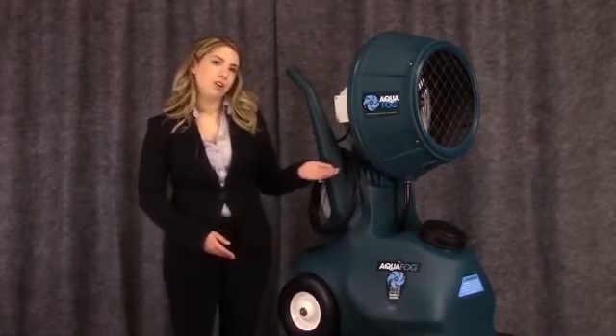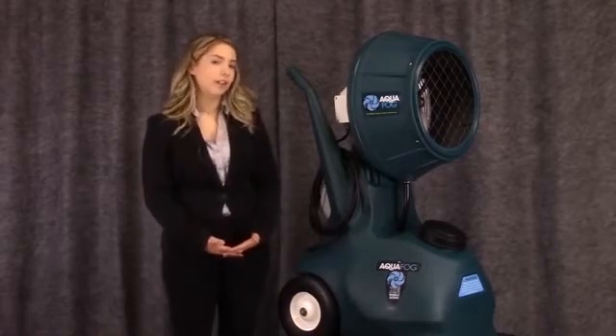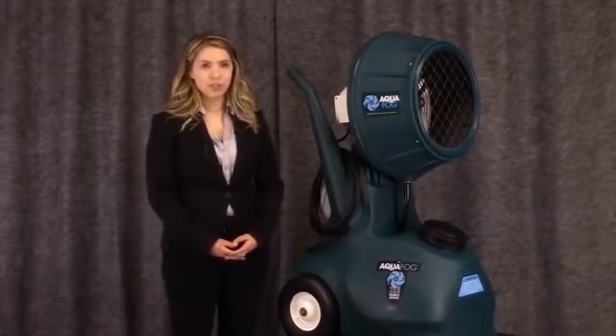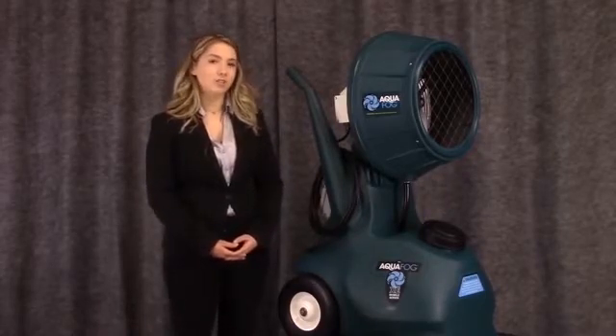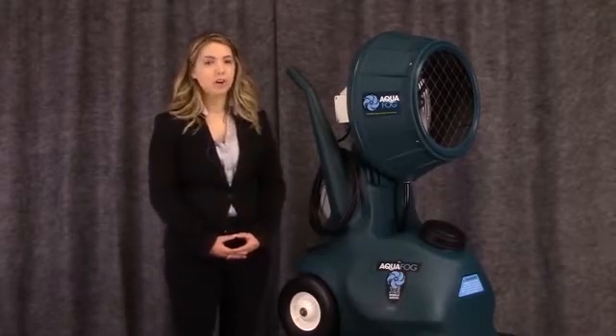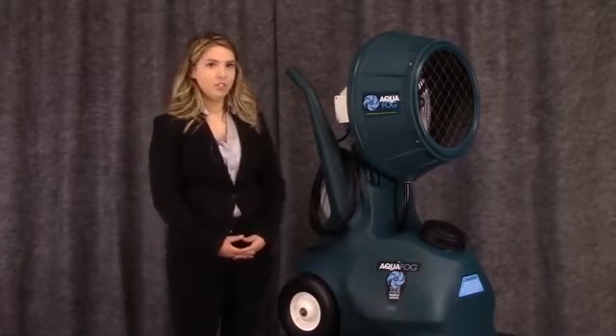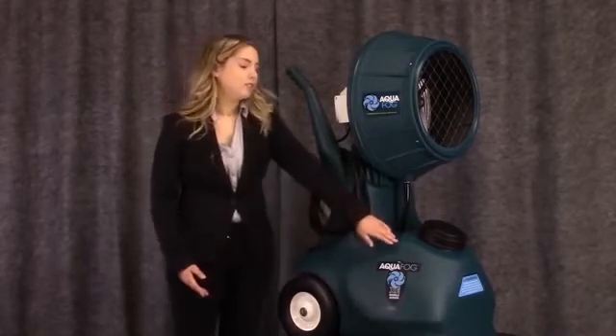This mobile version of the TurboXe is primarily used in applications where no drains are available. Typical uses include humidification, evaporative cooling, and occasionally fumigation. But the defining capability of this unit is water recirculation. These units capture water that does not get fully atomized and direct it back into the sump to be recycled.